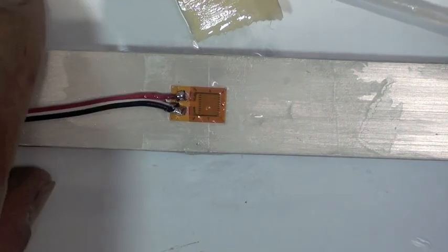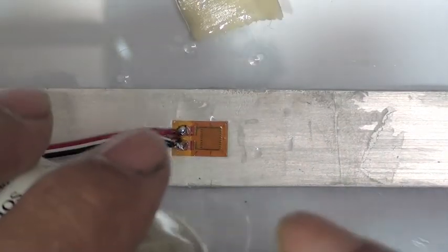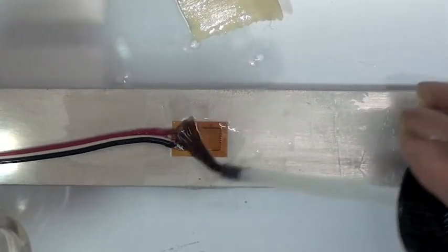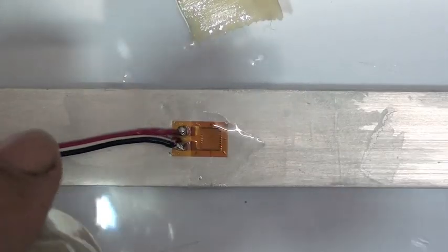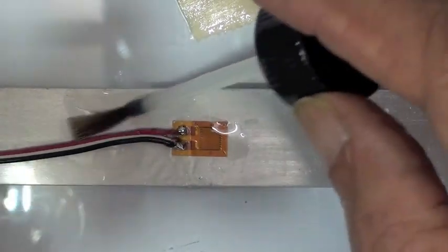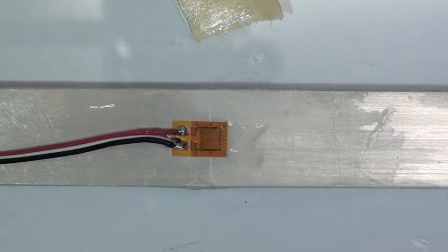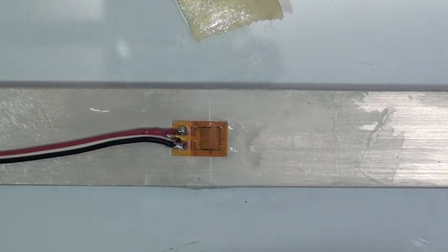Flux, in addition to causing low insulation resistance, which can cause increased noise in your measurement later, is also, for long-term installations, going to be corrosive to the thin metal of the strain gauge, especially if excitation voltage is applied continuously on the gauge. So we want to make sure we've removed every trace of that.